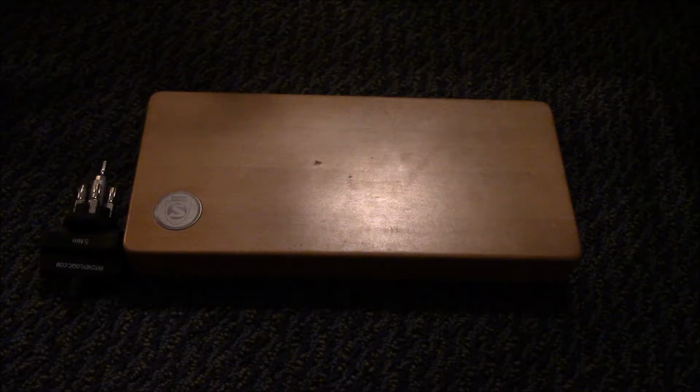Okay, so a couple of things you can do is you can go get a very high-end set of T-handle Allen wrenches. The problem is most Allen wrenches, even the ones that you buy at the store, are not going to be of a perfect quality. So there are some companies out there that make some, and a lot of them are Swiss companies and German companies, they have very high-end steel that they use. They're not using stainless steel. They don't use normal carbon steel. They use a special coated steel that's very hard, very resistant to corrosion, as well as resistant to rounding off.